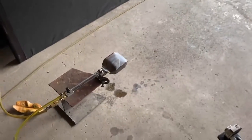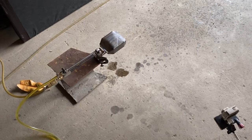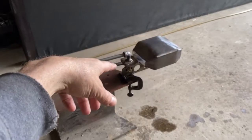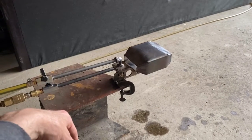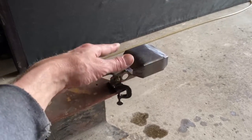I don't think the De Laval nozzle is a good geometry for this 2D laminated waste oil burner nozzle. We're going to go with a different internal geometry — we're going to alter the interior geometry to stay in line with conventional nozzle design. Because we're subsonic, we can't use the De Laval nozzle.